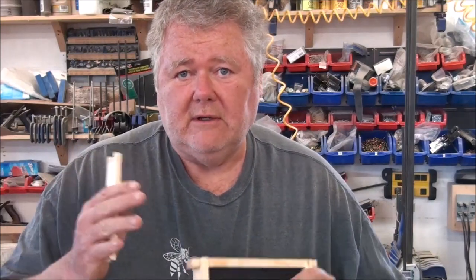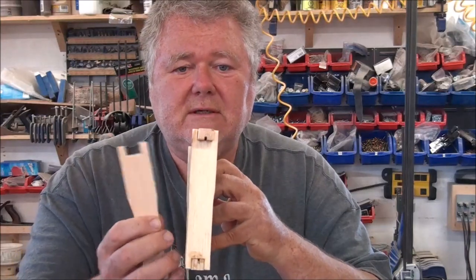So today I'm milling these end bars, because what we start out with is 1 3/8 end bar wide, and when you put 5 frames in half a box, so you have a standard 10 frame box with a divider down the center, and you put 5 frames on each side, it gets pretty tight. So as a convenience measure, I mill these to 1 1/4, and this one's already been milled, and you can probably see the difference right from there.